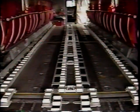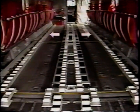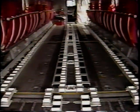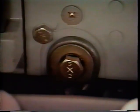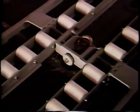HICS consists of three major sections. The cabin section, on both sides, is partly made up of the forward outboard roller assembly and rail, center outboard roller assembly and rail, and aft outboard roller assembly and rail. These components utilize 26 5k tie-down fitting assemblies, eight 10k fitting assemblies, and two ring plug assemblies at station 360. Four guide roller assemblies are secured in the center of the cabin section with 10 ring plug assemblies.